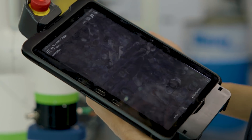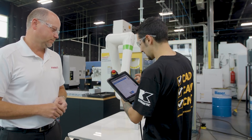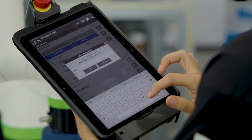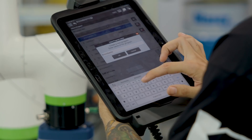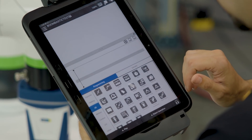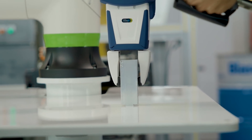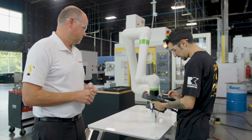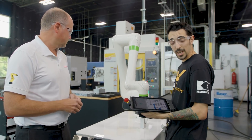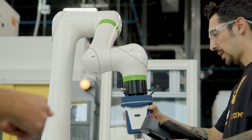So let's start a program. This is brand new, we're making it from scratch — we really want to get across to you guys how quickly you can do these things. We'll go to New, name it 'BoomBastic Test,' and save that. There's really no training needed, you can just pick it up and use it as is. I just recorded this point. I'm going to record the gripper closing so we can keep that there. I'm also going to let the robot know what it has in its hand — you need to input the weight of that, and we input that earlier today.